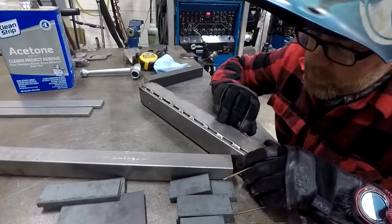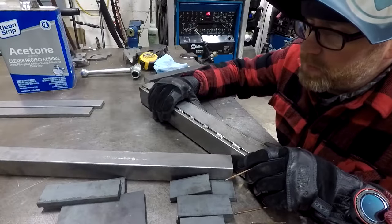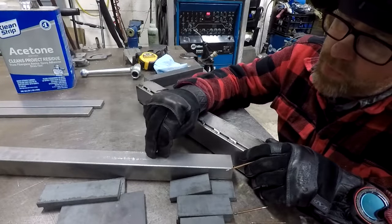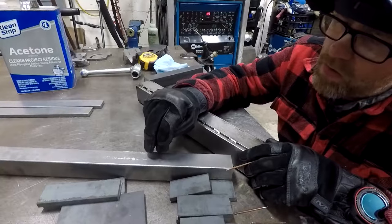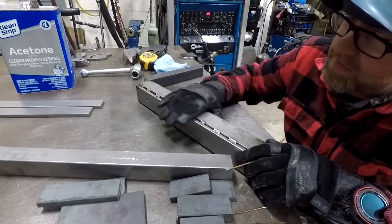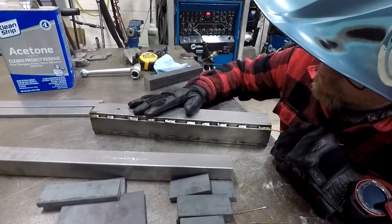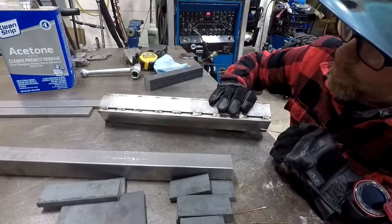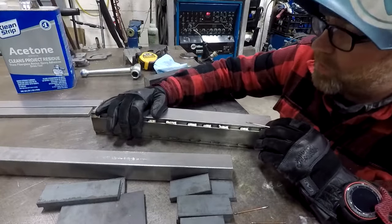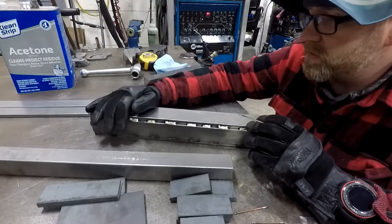What we're doing here is welding it in sections all over the place, trying to keep the warping down to a minimum. I went ahead and put 16 thou spacers between this bar, and once I tacked this up it seems to be working a lot better than the 8 thou. I definitely have a lot more weld on it than the other one, and the other one works.